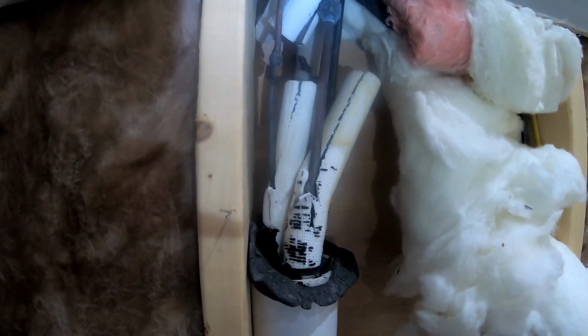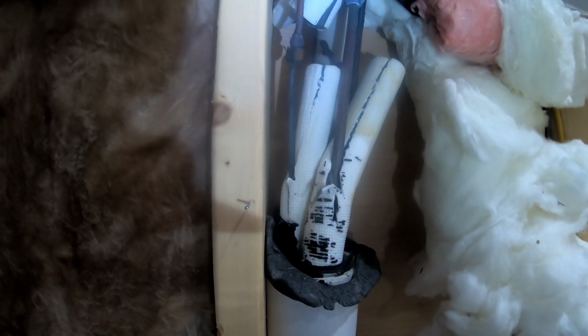So that leak that was blowing out there, or those leaks, I'm guessing maybe they started slowly as small ones. Maybe putting that 500 PSI on just created more leaks. I don't know, but it shouldn't leak like that anyway. But nothing up here looks like there's oil on the lines, and obviously it's indoors. So if moisture is creating the problem, there's zero moisture in here. You can see some water staining on the foam itself, but even then, it's a condensate line. That's what it does. I understand how you can't have moisture in the foam. They're saying the foam's reacting with moisture. That's asinine.